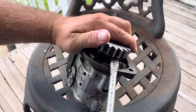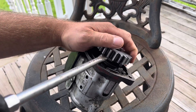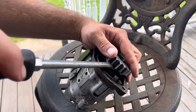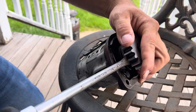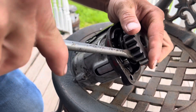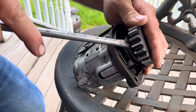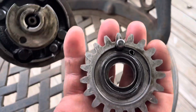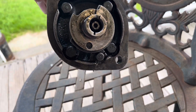I already have the new one in on this one. I don't want to wind it again because it took a little bit of time — just got to work it around evenly. And there you have it — there's the impulse spring inside the gear. Impulse pawls and an impulse stop right there.